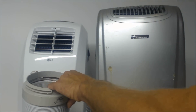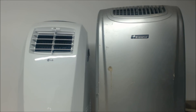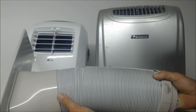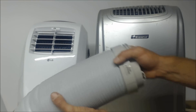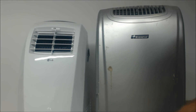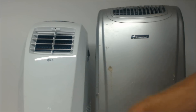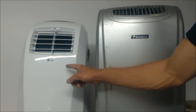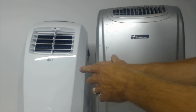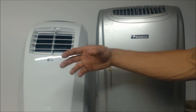These are 9,000 BTU units. I'm not really going over the brands here — these stand-up air conditioners with the flex ducting have worked pretty well for me. I put this right out the window, push the window down to it, use some blue tape or whatever I need. The exhaust hose screws on the back and is adjustable. I put a pan underneath on the bottom for the wheels to make sure there's no condensate getting in the house. The newer ones actually have a hotter exhaust and try to evaporate the moisture as they're expelling it outside, so there's no condensate buildup in the bottom.